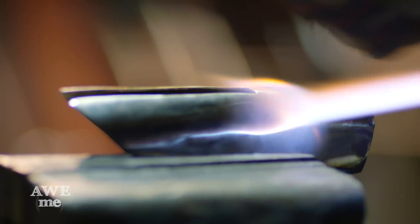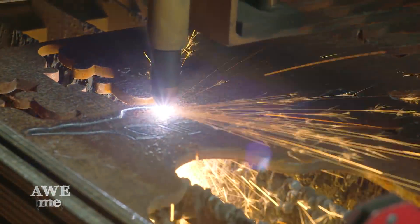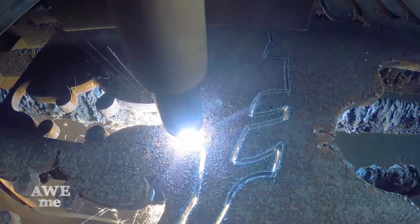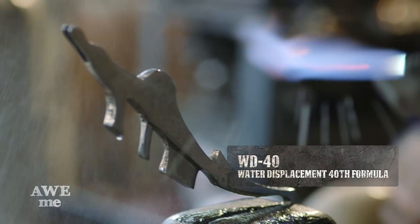After brassing many different overlays, I'm finally on my last one. There's a fairly thick central block that holds the blades. It has some additional pieces welded over top that also go in and hold the crystal and mount to the center staff. But it gives us a lot of strength since we're actually going to use this as a weapon. Using WD-40 on a torch, I blued the support to give it a darker look, more like in the movie.